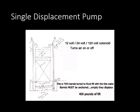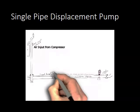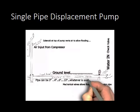If you don't want to use a 55-gallon drum, you can use lengths of pipe — 3, 4, 5, 6, 8, or 10-inch — placed at ground level or below. Water comes in one end, and a mechanical valve vents the air and lets the water come in, controlled by one solenoid at the top. These are very trouble-free, very good pumps.